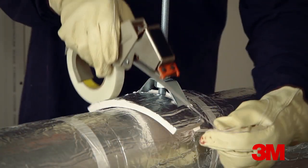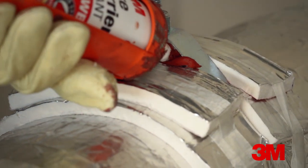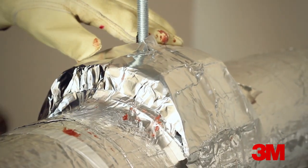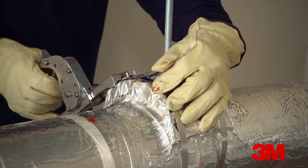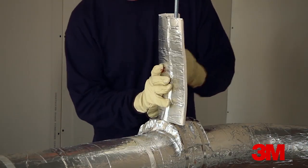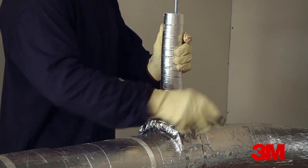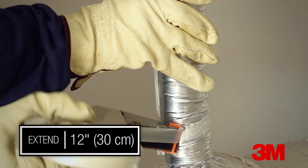After the layers needed on the conduit are in place, if portions of the body of the hanger protrude, straps of EMAT should be built up on the sides of the hanger body until the hanger body is covered. After the needed straps are in place, to complete the coverage of the hanger body, install steel bands onto the strap stacks. When wrapping a partial section of a rod, the threaded rod gets covered with EMAT for a distance beyond the EMAT envelope. The EMAT wrapped around the rod abuts the top of the stack of strips and will extend a minimum of 12 inches or 30 centimeters along the length of the hanger.